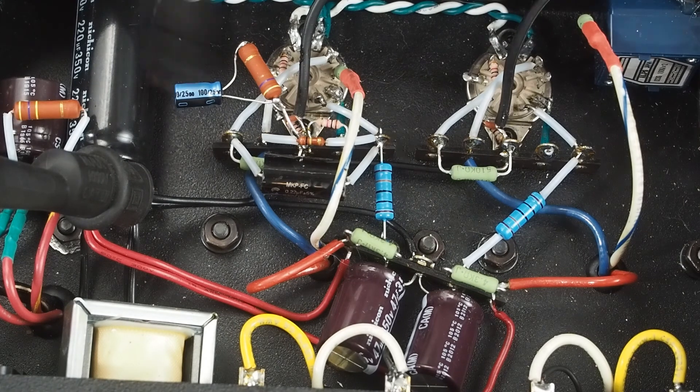That's pretty much finishing wiring up the tubes and tube sockets. At that point, once you've checked the voltages, we're ready to put it on the scope. In the next video, I'm going to put the amplifier on the scope — one channel without the feedback resistor and the other with it in place — to show you the difference in what that feedback resistor does to the amplifier and the quality of the sound.